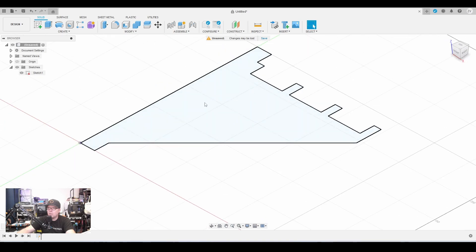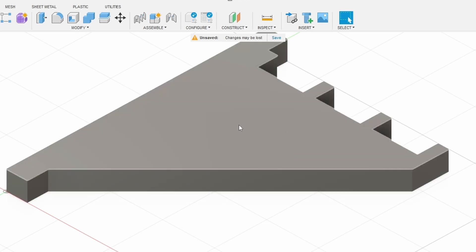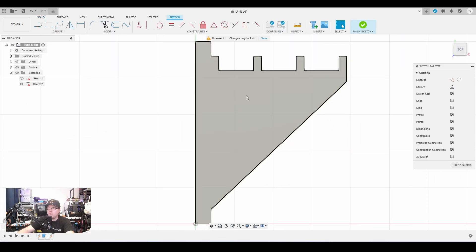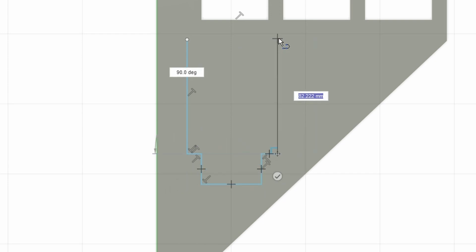Click on the home view, select the sketch, and we're going to extrude it — 20mm. Now it's 20mm thick. We're going to do the inner part, so we click 'Create Sketch', select this surface, and make the sketch inside using the Line tool. We go here and draw the inner profile.